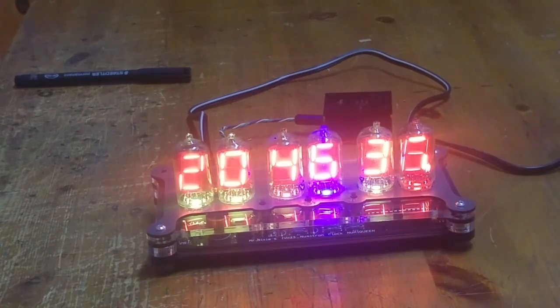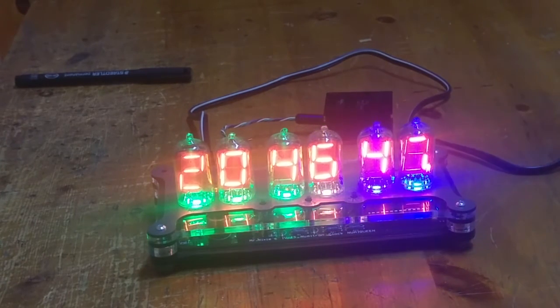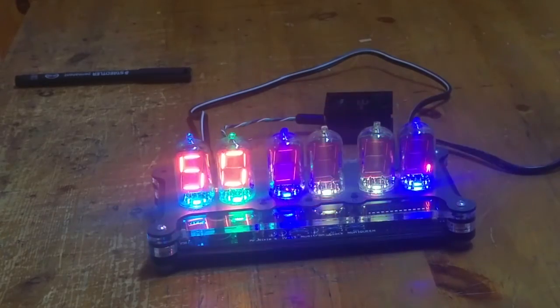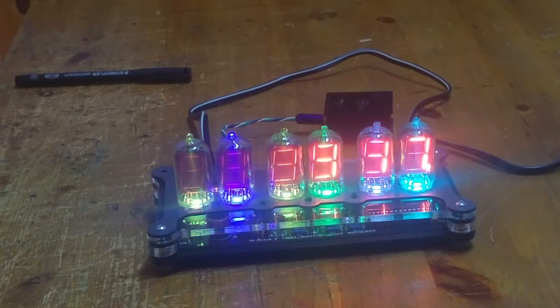It was set option 12 to 4, which is a GPS module, and option 13 to 1 for 9600 baud, and that was it, and it just worked. The NWTS acquires the time right away. There's no synchronization time, and it's just a really easy solution.